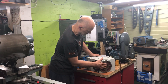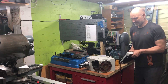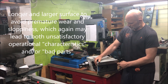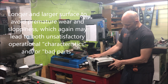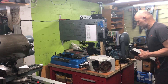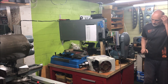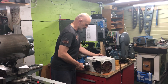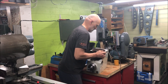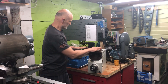Moving on to the head — we have this which to me is normally sort of an Achilles heel on these machines. This particular design is longer and more effective to hold up the weight of the casting, and it also has a triangle gib which is of course better. Then the head itself — in addition to just measuring up, probably just trying to get the highest possible amount of surface finish to the other part.